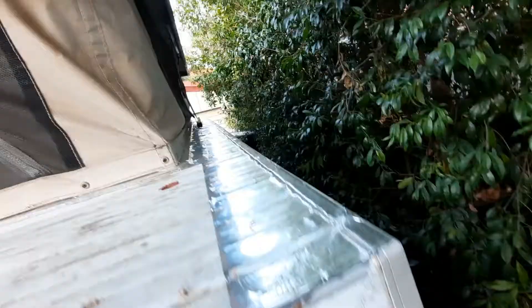Another thing I want to show you - I got weather tape, roofing tape. I've already done that as well this last week. You can see I've got all the weather tape all the way along the top, along the bottom there, and all along the top there too. It was leaking on the sides - when I pulled the inside skin away you could see remnants of water damage. That cost me $50 just to get that weather tape, but it will not leak now.